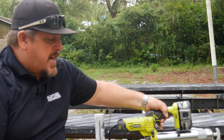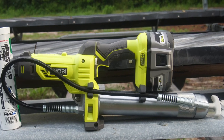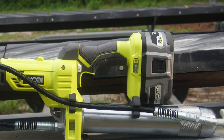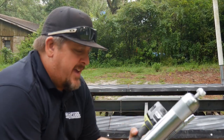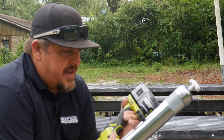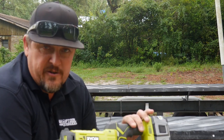A couple of things about the new P3410. On one battery this thing will shoot about 19 cartridges — 14.5-ounce contents, considered 16-ounce cartridges. So plenty enough to do a full day's work and then some. If you're doing more than that, you need to step up to an industrial gun anyway.